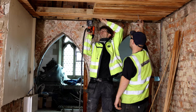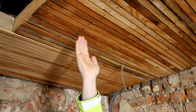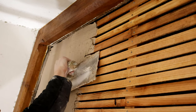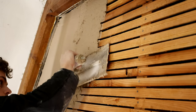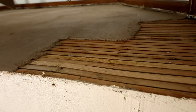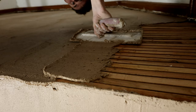It's the old way of plastering — nowadays you just put plasterboard up and skim it, but this is the old way of doing it. When you plaster on laths, you've got gaps in between the laths, and when you apply the plaster it comes up behind the laths and creates a key by hooking round the back. That basically gives it its hold. You plaster from the bottom, just apply it and leave it to naturally create its key. The plaster is really sticky and you have fibres in it to hold it together. It's so labour intensive — you've got to apply multiple coats and nail every single lath to every single joist — whereas plasterboard you just stick up and screw. But this is definitely the way that needs doing in restoration jobs.